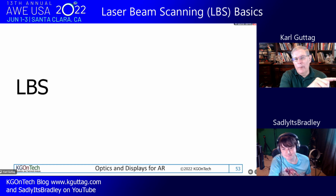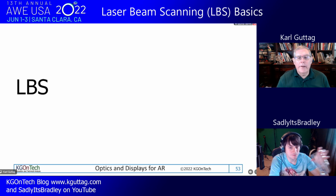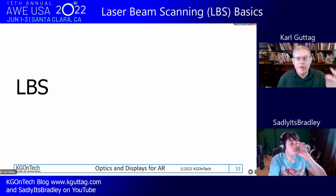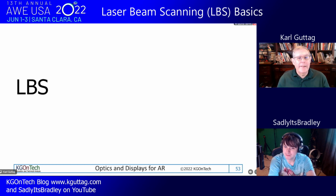Usually one mirror is scanning really fast, and there's another mirror going more slowly that can reset back up. So one mirror is just oscillating, and it's a complicated process, changing velocity constantly. So it's really complicated to control the laser with the same brightness, because it's speeding up and slowing down all the time. That means the brightness is constantly, inherently changing, so you have to modulate the light just to try to create uniformity. The laser is always scanning nonlinearly. It's not scanning in a rectangle. So what happens is scan lines do not equal pixels.